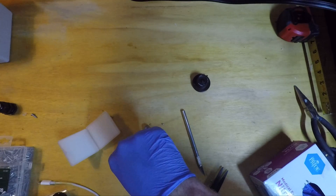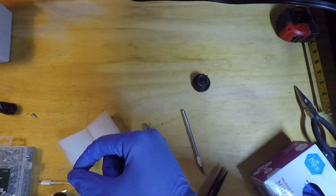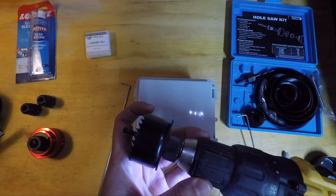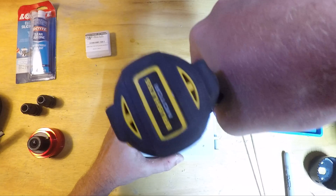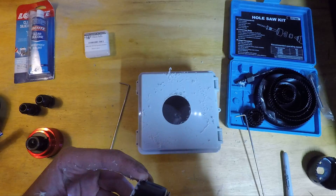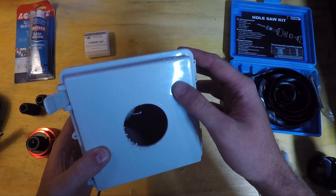The UV-IR cut filter is pretty easy to install — all you have to do is pop the cover off and swap out the glass. I also had to get some hole saws to attach to my drill, as well as some silicone to seal up any hole that was made into the project box. I drilled the hole so it would fit the camera snugly, with the rest of the body sitting inside the project box. After drilling the hole, make sure you clean up all the plastic debris so nothing gets on your lens or on the acrylic dome.